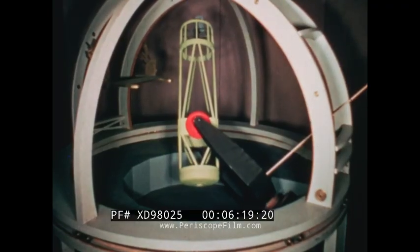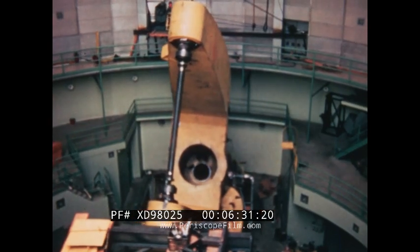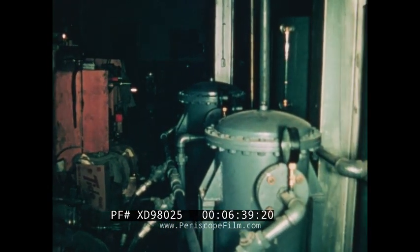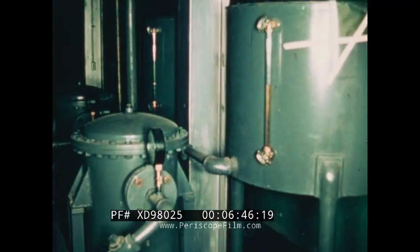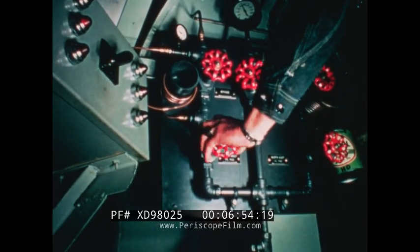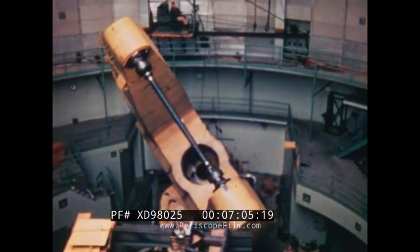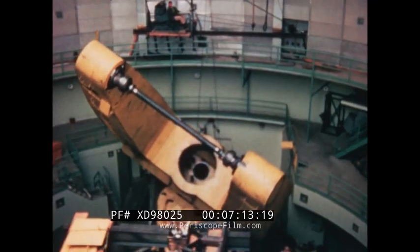One of the basic actions of the telescope could now be produced. This was called right ascension — the rotation of the entire fork about its polar axis, or handle. In the final stages of completion, a huge gear would permanently rotate the fork assembly. The entire fork, weighing some 100 tons, was supported by oil pads which were part of the base frame. A hydraulic pumping system forced oil under pressure to these pads, and electrically operated panels and valves controlled the flow of oil. An oil film two thousandths of an inch thick — the thickness of a piece of paper — supported the entire assembly, resulting in no metal-to-metal contact. Friction was so slight that it could rotate this entire assembly with very little effort. What had appeared to many to be an impossibility was now, in fact, a reality.